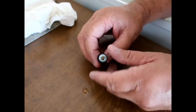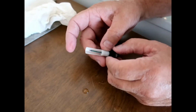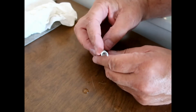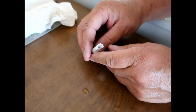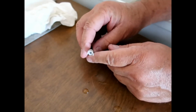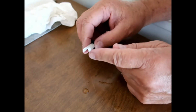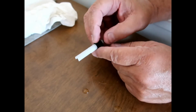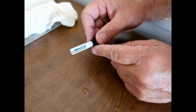So this is the black sensor. You see that the other ones had just a wire. This one has a protective cover over it. So when this goes into the tank, that's setting down this part so that it has like a protective hood over it. That's supposed to keep like toilet paper and solids from sticking to the sensor, which is underneath here.